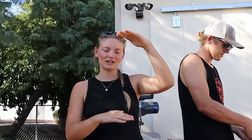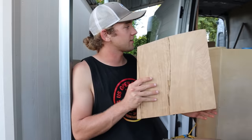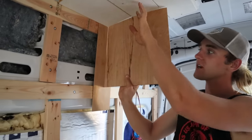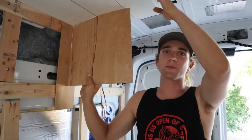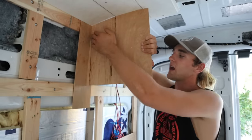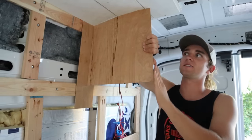We just spent some time finalizing the measurements for our upper cabinets. We are making them 14 inches tall, and in the kitchen it's going to be 11 inches total deep — and that includes the door of the cabinet. The back area is going to be a total of 13 inches deep. We've been working on these templates for a little while now — these are going to be the dividers in the cabinet and the end pieces. We've been going back and forth making sure this is completely up against the back wall and the ceiling, with temporary shiplap pieces on the roof and back panel to simulate what the cabinet is going to be sitting up against, making sure this is exactly zero degrees and exactly 90 degrees.